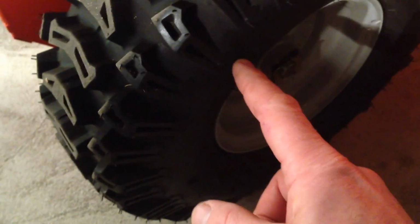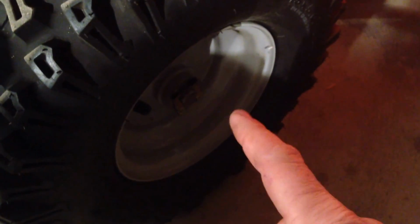The one comment I just want to make is if you do buy a snowblower, it's very important to get metal rims. Only get metal rims. I had previously bought the Home Depot special, and it had plastic rims, and it would lose pressure. And basically, after about 6 months, the tires would fall off the rims, and you couldn't even add air to them because it was off the rims, and I had to go to an auto repair shop, and they had extreme difficulty doing it. They took out the pin, they forced air in. It was impossible. I mean, I don't even know what to do.